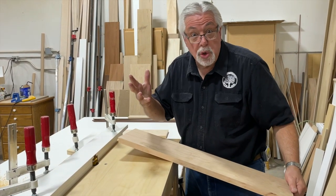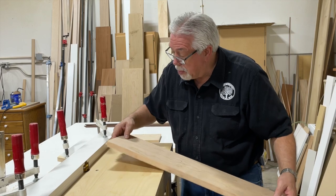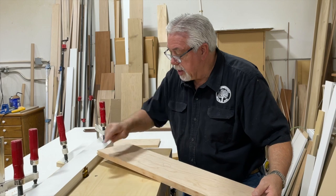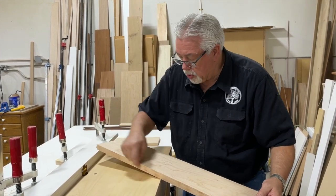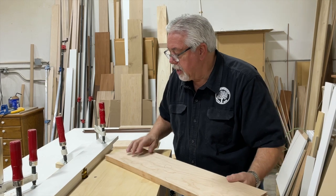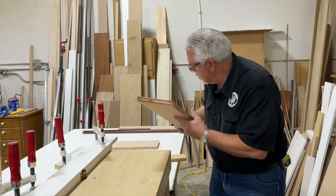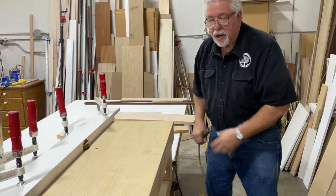Because we're just doing one picture frame, we're all done with the rail part — we've done the two ends of our rails. We're ready to go. We'll set up our router bit now with the stile cutter and make the grooves on both sides. We have to change bits, so first thing we do is unplug our power for safety and change out our bit.